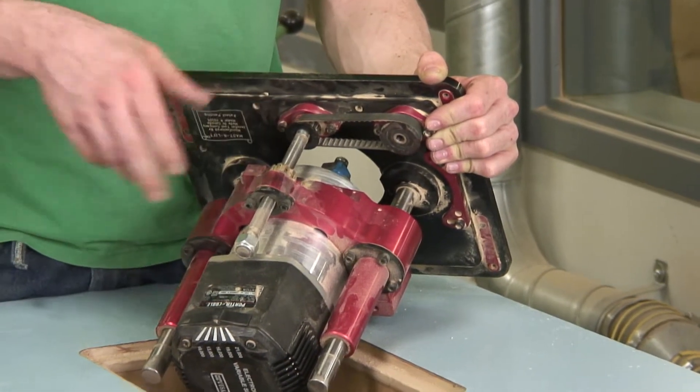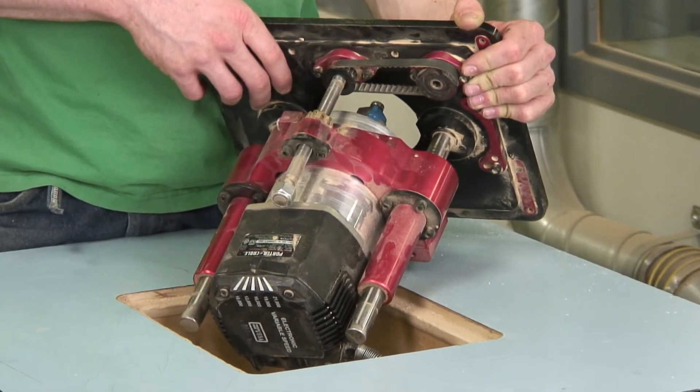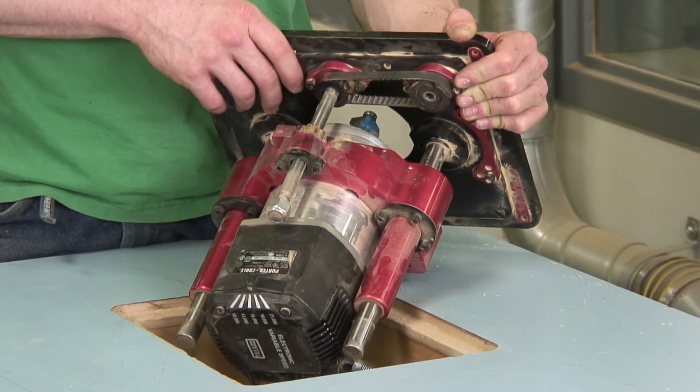Other things also, just like the plunge router, you need to make sure the cord's staying in good condition, that the inside of the router is staying fairly dust-free, and that the brushes on the inside of the motor that make contact with the armature are also in good condition. Thank you very much.